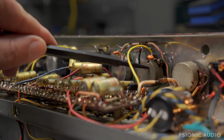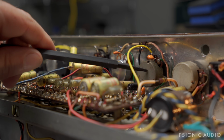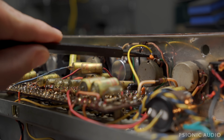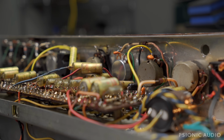Right now we've got the brilliant channel without the top boost added. The top boost will be added last on this amp. I'll rebuild that. I do have the bright cap already in place. The brilliant channel of one of these without the top boost would not have had a bright cap. This one does, and this wire here is temporary just until we return the top boost card to the amp.